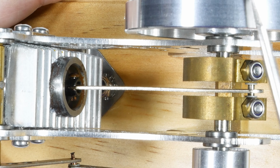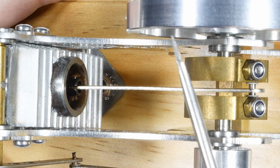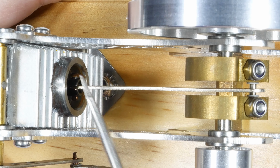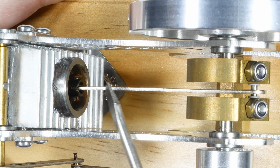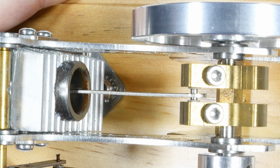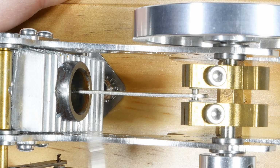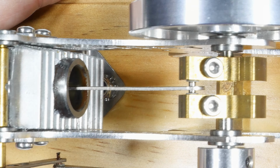Yeah, I had also considered putting fins on the flywheel, but again, that would create way too much draft. So I think I'm just going to try some duct tape and try to form something out on the shaft here so that when it goes back and forth, it just pumps the air and splashes air up against there. Okay, let's try that and then we'll go out and run it.